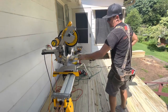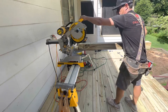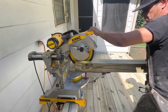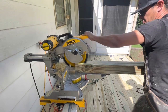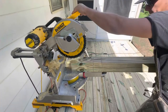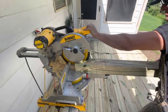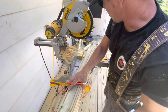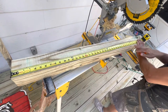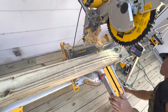The best way to do this for me is to take it on a miter saw. Put yourself a little block, a little spacer that gets you the offset you need, because your blade's going to be in your way. Get a little block, line up your line and make the cut. Now I'm going to go basically at my deck height — I've got my 36 inches where my handrail spacing is going to fall, and my three inches of space. Then this represents the deck board.